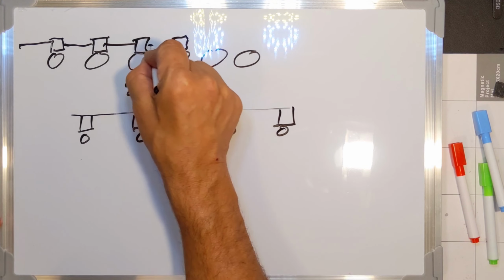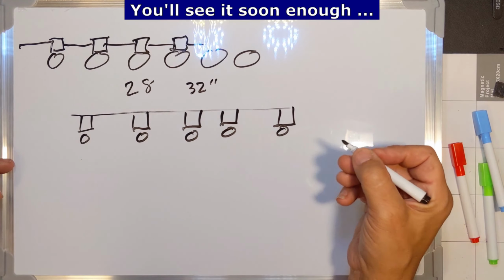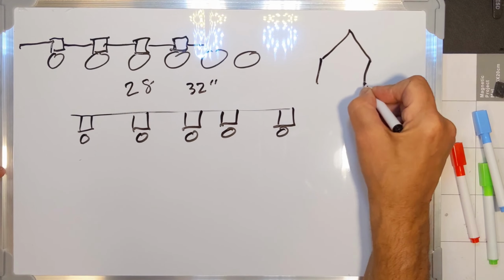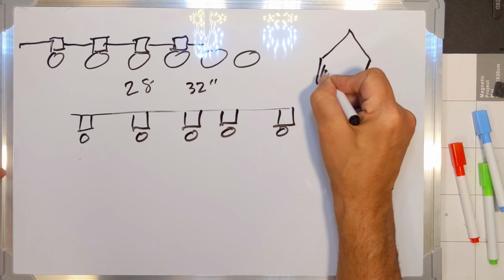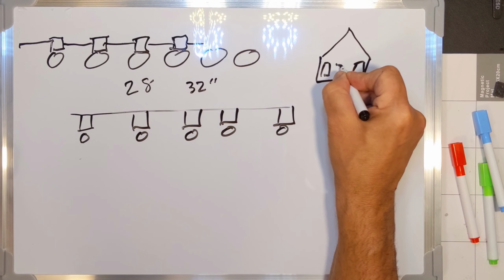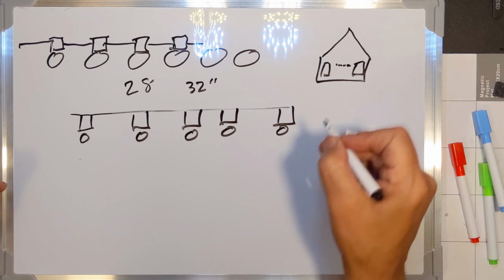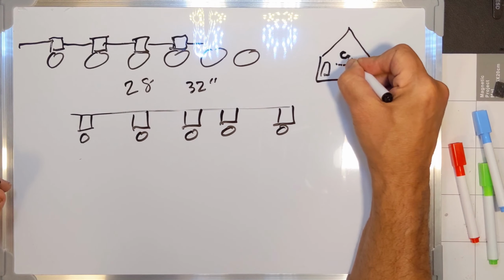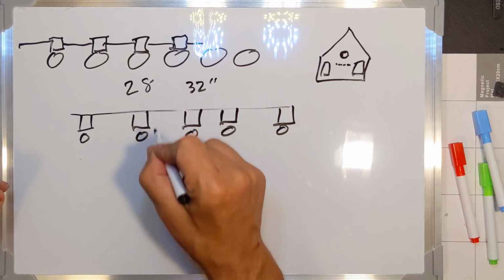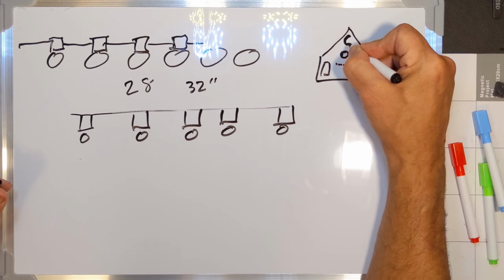Let me give you a blown-up view of it, and I can also show you the render. The coupler board is shaped kind of like a house. It's got a connector on this side, a connector on this side, and a connector in the middle, which goes to the bulb, and a hole, so that between the connector and the hole I can securely mount each bulb to the coupler. And then there's another hole up above it.